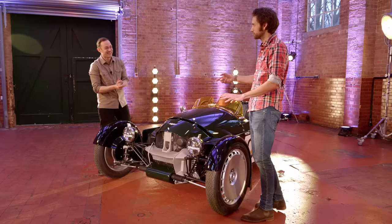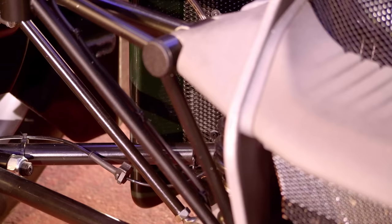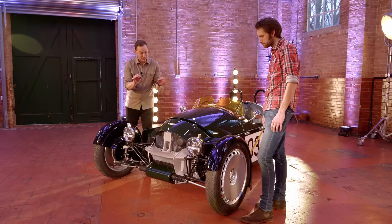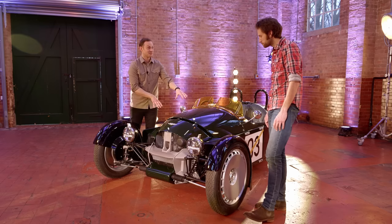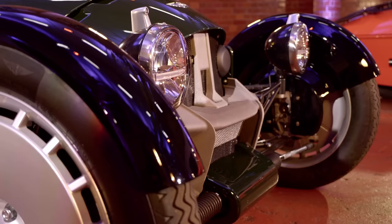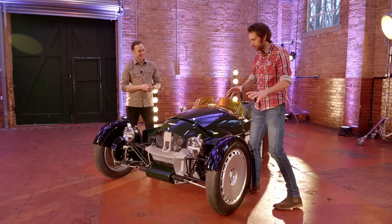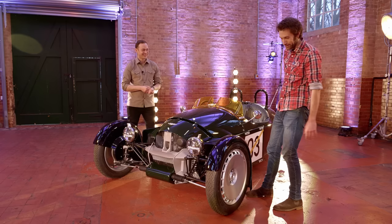So everything was positioned behind those wheels — even a little pulley wheel sticking out the front got a cover on it. I wanted a little painted spiral where it was spinning, but we had to cover it. First, holding the engine. Second, they're holding all of the corner packages — you can see all the wishbones, the push-pull rod suspension, all that mechanical interest. All the lines and arms are quite thin, allowing air to pass through. Because the third function of these castings is to divert air into the radiators — we now have to manage a cooling system, which we didn't have before. We're really pleased with the very mechanical, functional face that, like the old car, lets you read the purpose of the front end. There's honesty to it, which is really important to us.